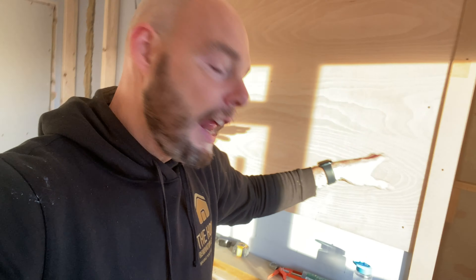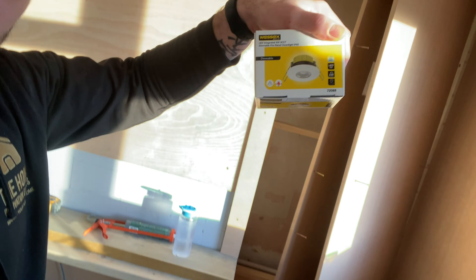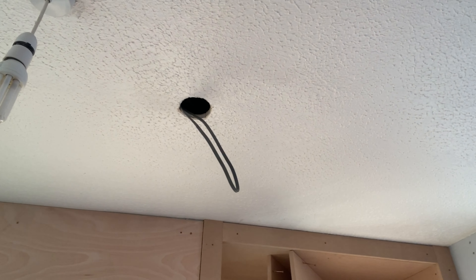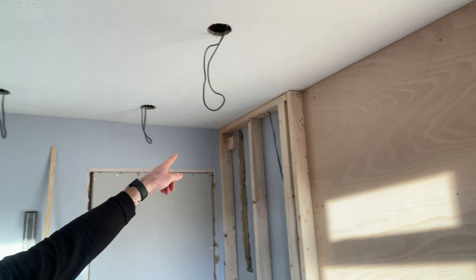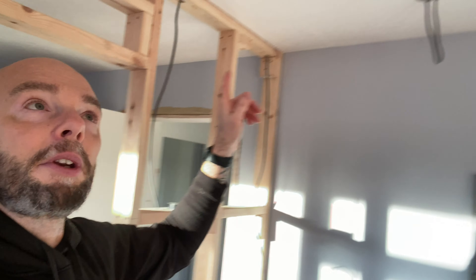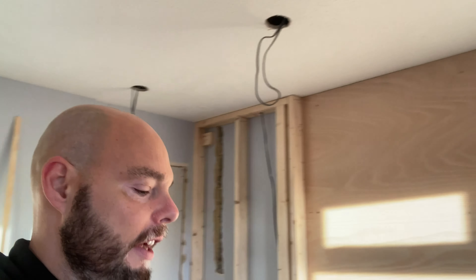The other thing I'd like to do is lights - I have many lights now. I did the wiring yesterday so that's ready to rock and roll. I've got my 1.5mm cable which will be for the switch, running across the roof line and dropping down. This one here is for this room, and then the second line I'm going to run will be for the spots as down lights. So that's ready to go.